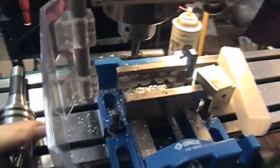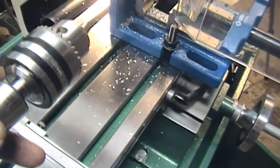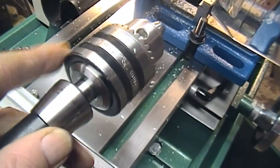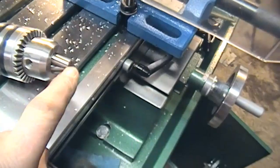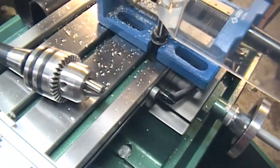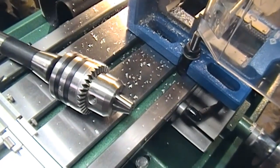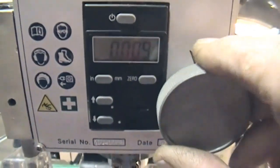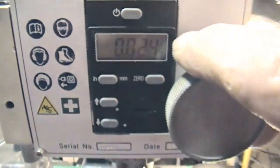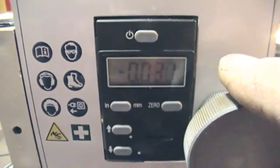The drill chuck actually runs fairly good, except when it's rotating. When it's rotating, this area and the outer section seems to have a slight wobble. But that doesn't really matter too much, because what comes out of here is probably running a couple of thousandths or something like that, which is probably acceptable for most drilling operations. Still messing about a bit with the fine feed on the quill — quite useful, it makes it nice and easy to dial in just little bits and pieces.